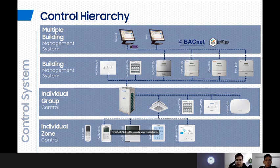In terms of power monitoring, we can do that. I mean, we can check based on individual tenant. But so far, we have never done power monitoring combined with auto billing software. Maybe in the future, we can try to explore. I believe it can be done, because basically from power monitoring, we can obtain the power consumption in kilowatt hours, then just multiply with the TNB rate. Maybe later on we can explore and get back to you.